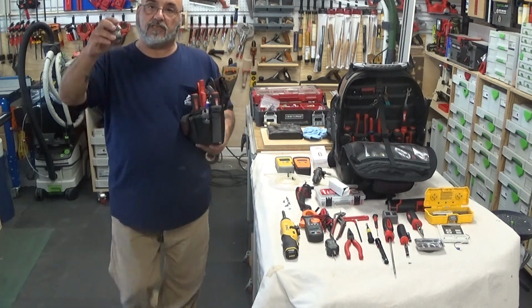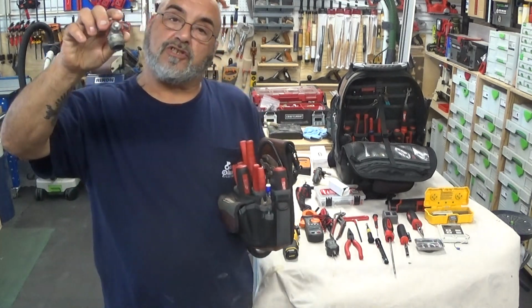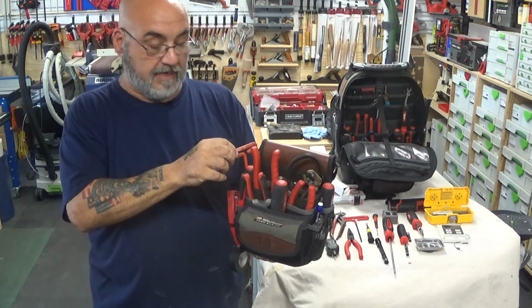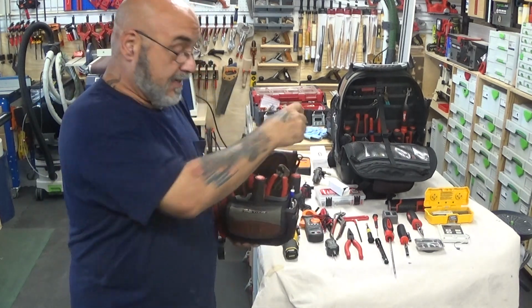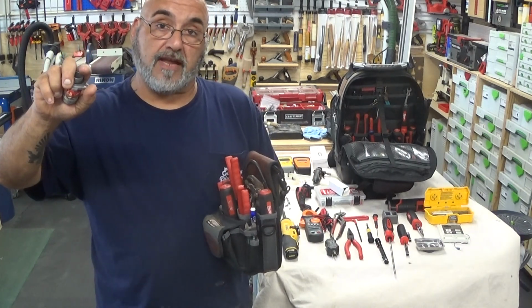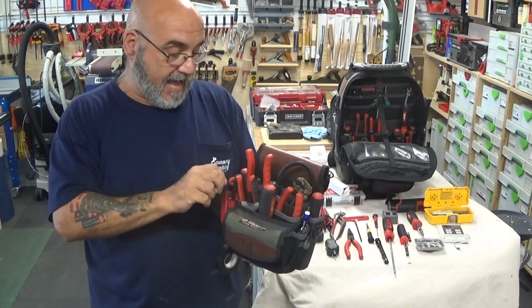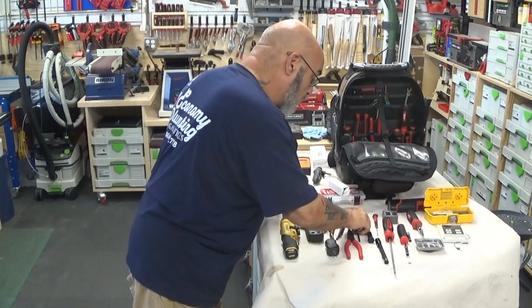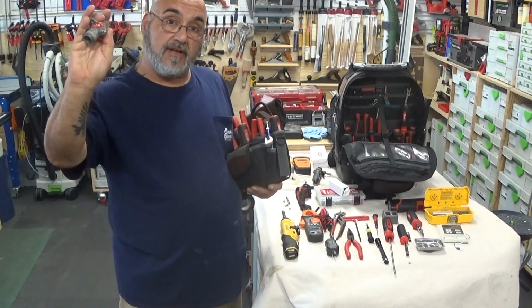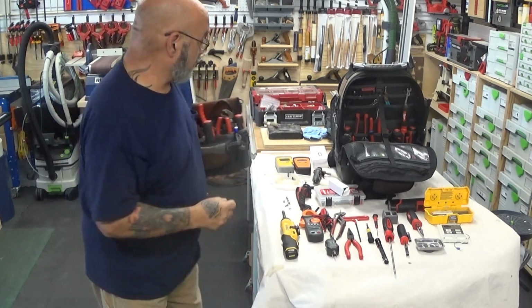This is the gas inlet. Now, this one has an Allen screw for this Allen key. The newer models have a machine screw inside of it. So you're going to need to have this Allen key, which is 3/16. That is what removes this screw to check gas pressure.